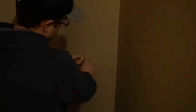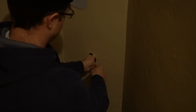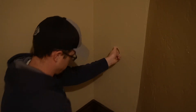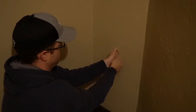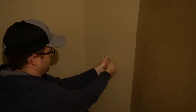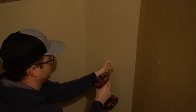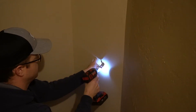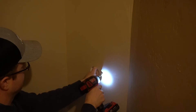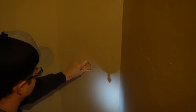Put that piece of wood into the hole and then screw into that piece of wood through a good part of the sheetrock. You should know when it catches because you'll feel it. Once you've got that in, put a screw in on the other side.